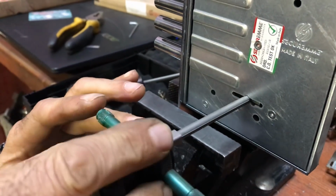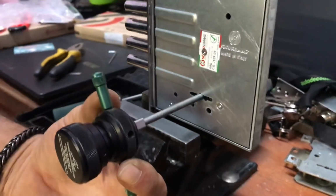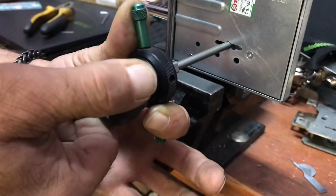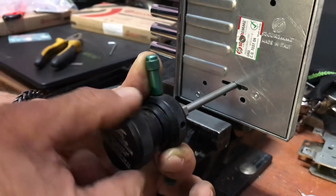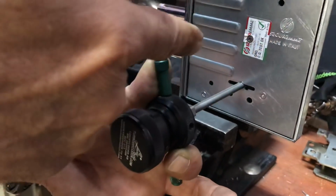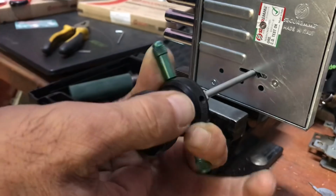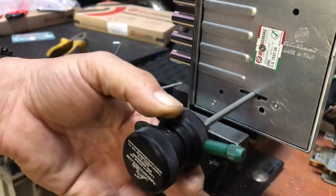Insert this carefully, go in the center of the lock and grab the bolt. From this point on the green handles here we have to apply a not very strong tension. Keep the tension and start to rotate the back wheel to the left. Turn back and release. All we have to do is only this. Now the lock is in anti-pick. We have to discharge it and start to rotate a little bit more the back wheel. The first turn of the lock is done.